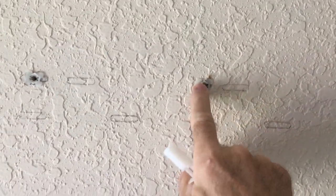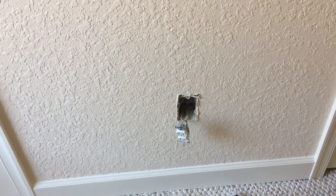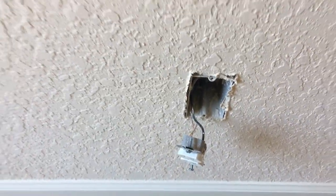And what I did was, in my case, I did have a stud here, and I'm going to end up putting a socket behind the TV. So that'll require me to pop a hole there, with a reciprocating saw or whatever, and run my wire down and tie it into this socket. And if you don't know electrical, you shouldn't attempt that. But this is pretty easy. I lucked out. This was the end of a circuit. So, but anyways,